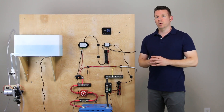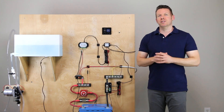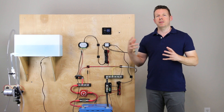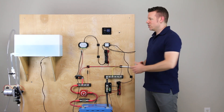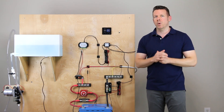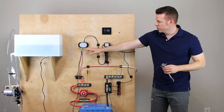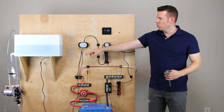I've got a couple of sensors we're going to be looking at today. I've got a voltage-based tank sensor taped to the bottom of the blue water tank over there. This is a Safari ultrasonic sensor, actually made for steel propane tanks, but for time constraint reasons I just taped it to the tank. They do have one with adhesive that bonds to plastic tanks like this. We can also do this with resistive tank senders — that would go into the right side of the ST-107, going to common and then resistance input number one.